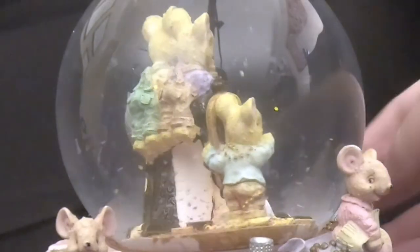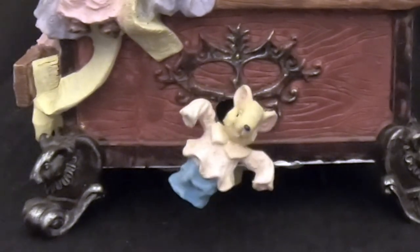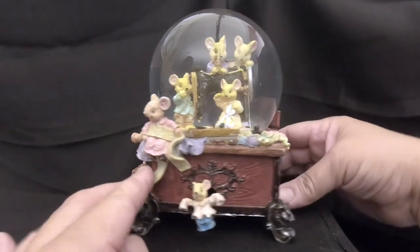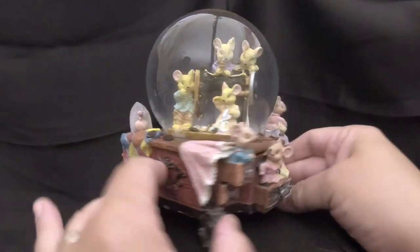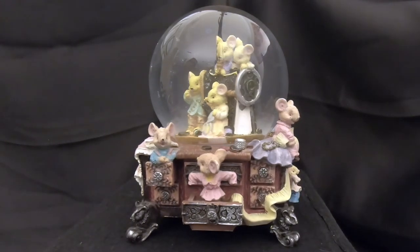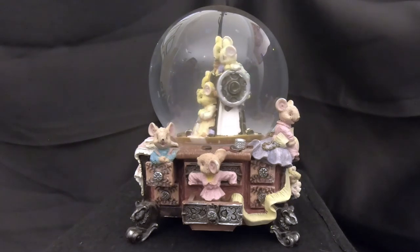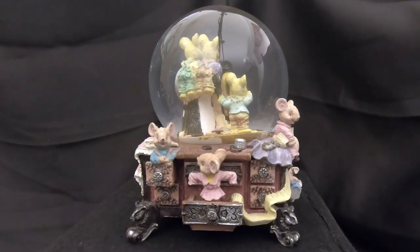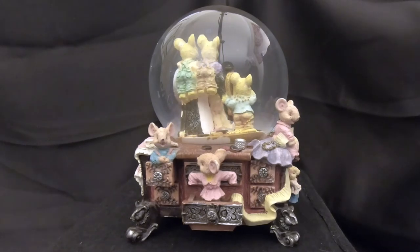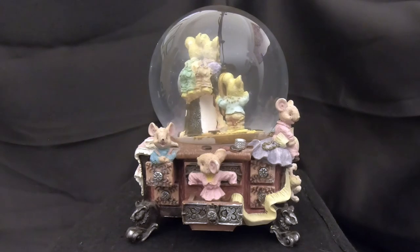It's working, and you can see for some reason there is a mouse coming out of the side of the base twirling. That little guy — I'm not sure exactly why he's there. That's an honestly dangerous spot for that ornament, but he's still there. It's all in good shape. The figurine is turning on its own with no issues. Between cleaning up the mount, fixing the twirling assembly, putting a little oil in, and not tightening that grommet too much — we've got something working! Ali says this is another one of her favorites because of the old-timey sewing machine, the mice, and Dolly Parton's 'Nine to Five'!